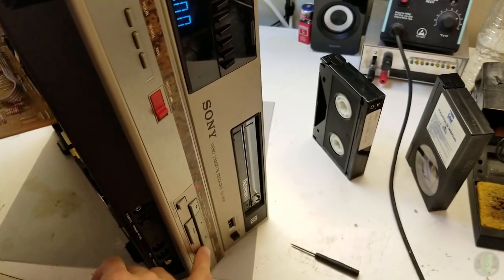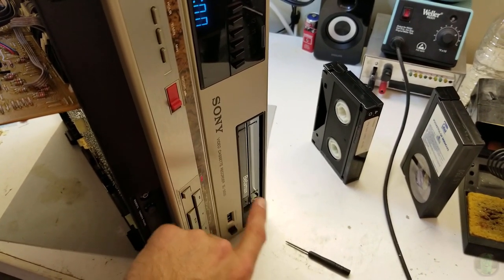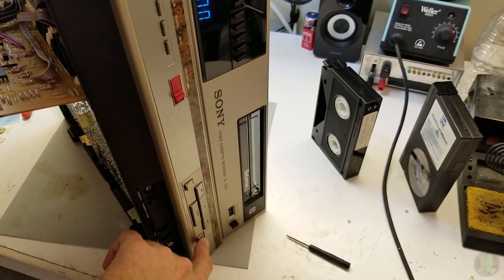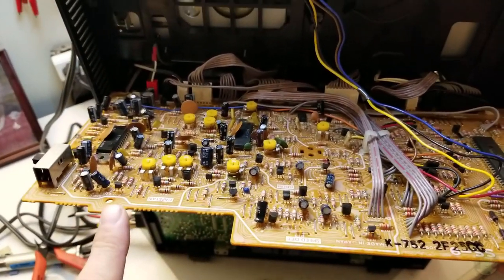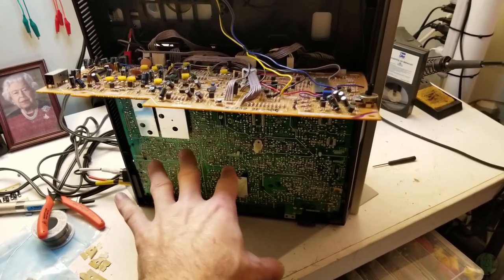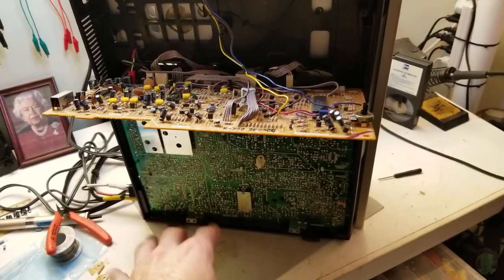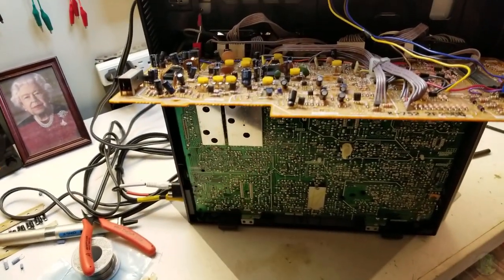As soon as I stopped filming the Beta 2 tape was working just great. This is a Beta 3 tape - I was using music videos, which I'm not really going to show much of. It's very good to get the playback speed exact. I'm gonna say that's good. All that's left is the Beta 1 adjustment, and I think there's one more Sanyo cap - a 22 microfarad - on this board that I'm going to replace anyway. It's in the chroma circuit; the color seems fine but if those were bad then that blue Sanyo will also be bad.